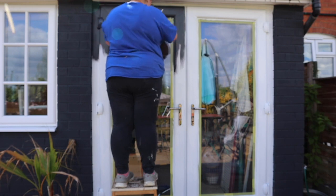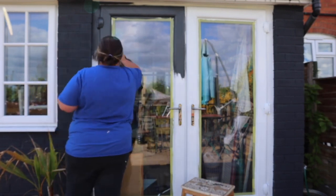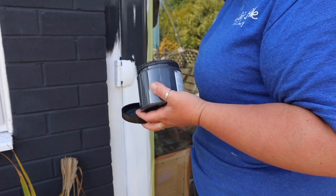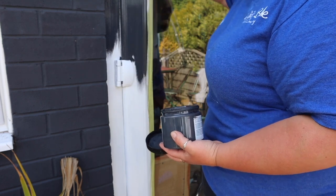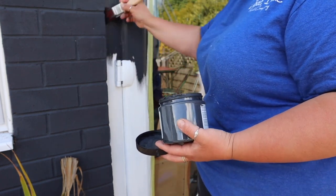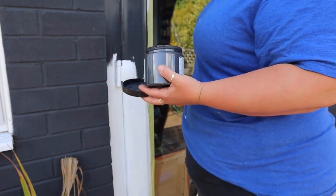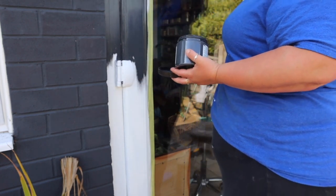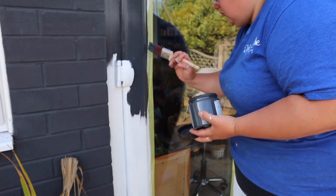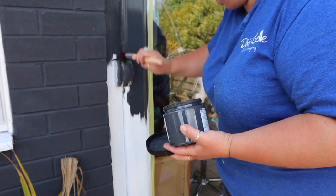Don't judge the mess inside where you can see through the windows — that's actually my workspace where I paint all my furniture pieces, hence why it looks like a tip! You can see on the zoomed-in picture how well Black Sands is covering. It's one of my go-to colours for dark coverage because it's fabulous and really easy to work with. I made sure the sun had completely gone around the other side of the house before I started painting — that goes for the Slick Stick too. You don't really want to be painting in direct sunlight, because it speeds up the drying process, which means the paint can start to dry before it's had a chance to self-level, and you can end up with an uneven surface or unwanted texture on your finish.